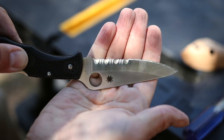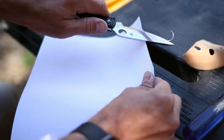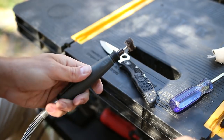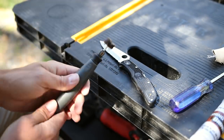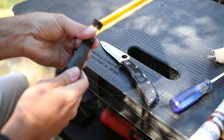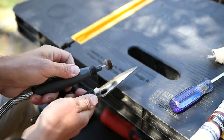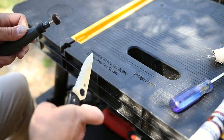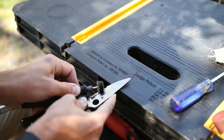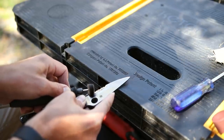You can see how much shinier that one is compared to the rest of them. Now I'm only going to test this first serration. To finish this thing, I'm going to use my Dremel — I just have a cloth polishing wheel and my brown polishing compound. This is the exact same stuff I use to polish frets when I'm building guitars. I'm going to set my Dremel on a low speed setting, add some polishing compound, and then the direction it's rotating, I want it to rotate out away from the edge. I'll run it along the edge like this, then go back and do the exact same thing on the other side. I like this method because it's a lot faster and you don't have to worry so much about maintaining the proper angle of bevel — it's going to be a lot more productive.